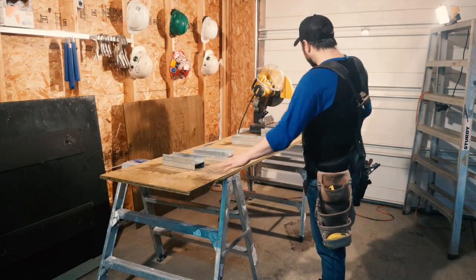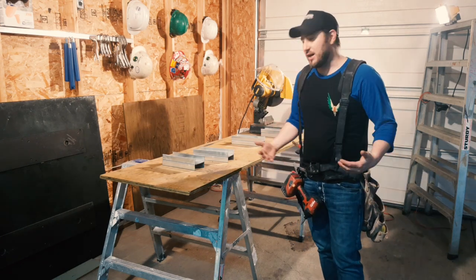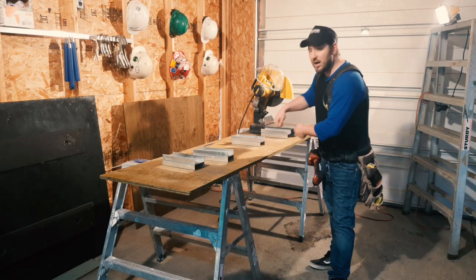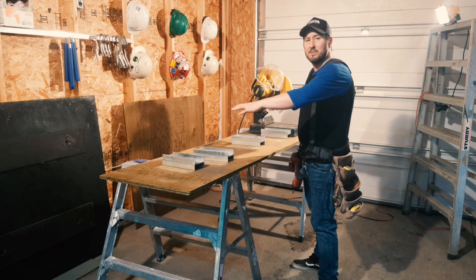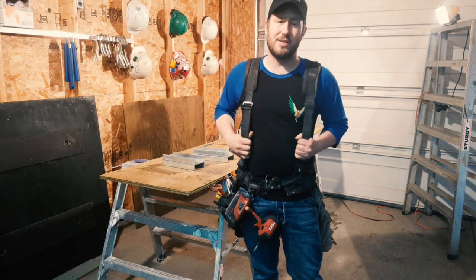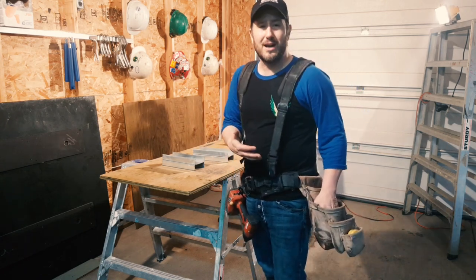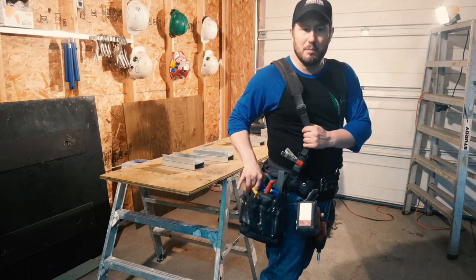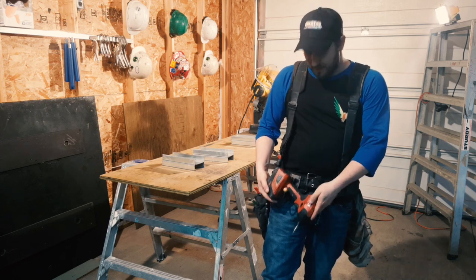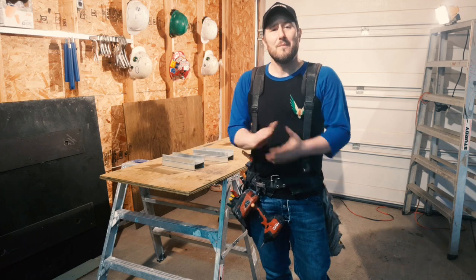This is a very typical setup on site for a steel stud framer or drywaller. You have three foot benches — the most standard benches in our trade — and just a random piece of plywood for the top. You use it to cut your drywall strips and put your chop saw on. As far as a pouch goes, it's very simple: use suspenders — always have suspenders. Padded pouch, padded suspenders, the four pocket screw pouch is what I use, and we always use an electrician's pouch for our tools. Always get an extra clip for your screw guns to hold the drywall gun, the impact, and I have a hammer holster as well.